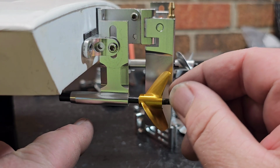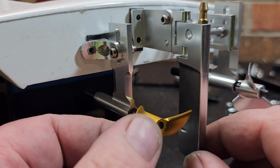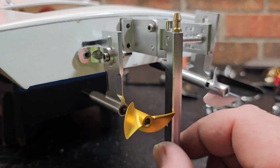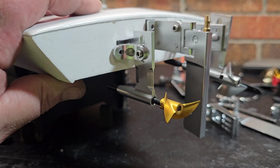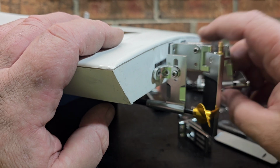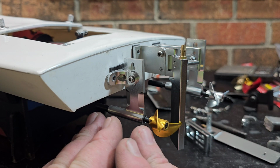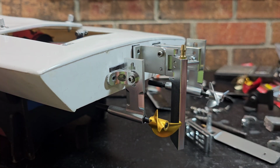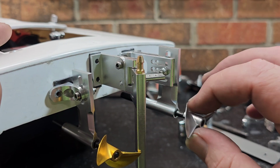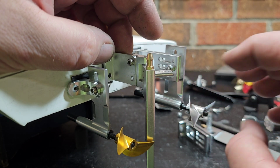This is what I really wanted to run, and I'm not going to be able to run that with the current rudder. Even if I use the original bracket, it's just not going to work. It's going to run into the prop. So I'm kind of ruling it out. And I really hate to, but I've already run a hydroplane with my strut forward. I know it works in a straight, so I'm actually kind of curious to see how it works with the extended strut. With the extended strut, I got my gap here for my drive dog.